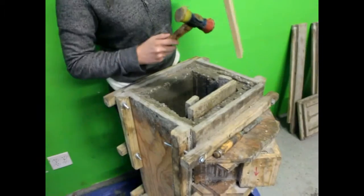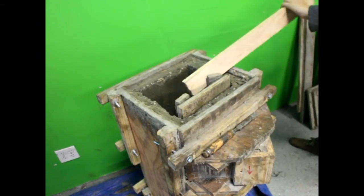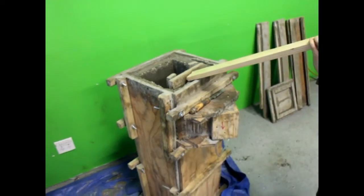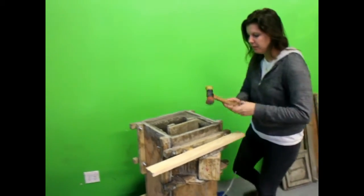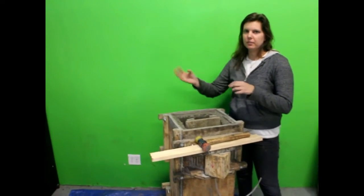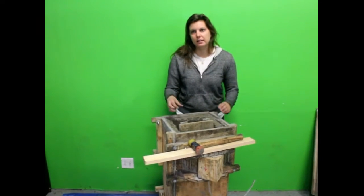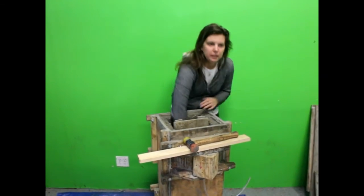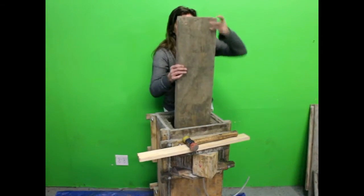After you've got the L and K pieces out, you're going to work on the E and F pieces. Using scrap wood and a rubber mallet, you want to tap in the ears first, then the other hinged pieces — these flaps. The last thing is to hit the bigger piece in. Sometimes it might get stuck towards the bottom if some concrete seeped in, so you might need to take a rebar or chisel to get down in there and unstick the bottom, then just pull it up.